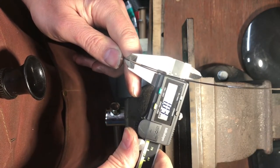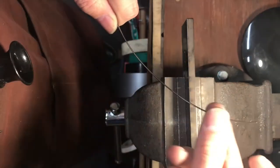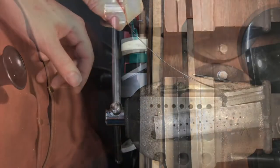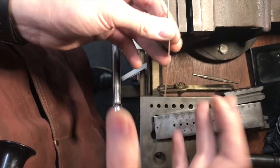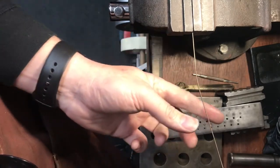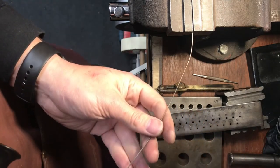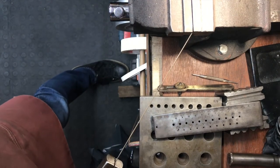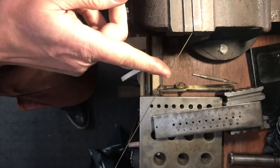1.03 is pretty good. What I'm going to do now is straighten this by heating up the wire and pulling on it, to get that curve out of it. Because of that, we're actually going to thin the wire out just ever so slightly, which means we'll probably end up on exactly one millimeter. I've annealed the wire — I'm going to now just pull it straight. This is all to do with that process of hardening and compressing the metal, which is what gives it its strength. I'm going to put one end in the vise — as you can see, it's not perfectly straight. I'll use pliers and tongs on the other side and give it a consistent pull in one direction. Now I'll release it with a perfectly straight wire. I'll be cutting sections of this to make the collet.